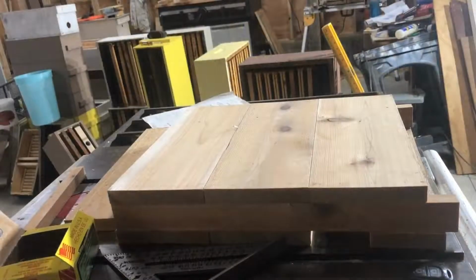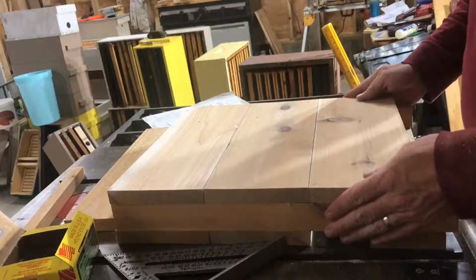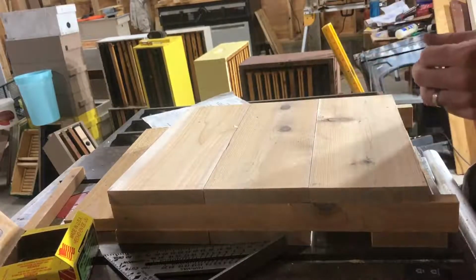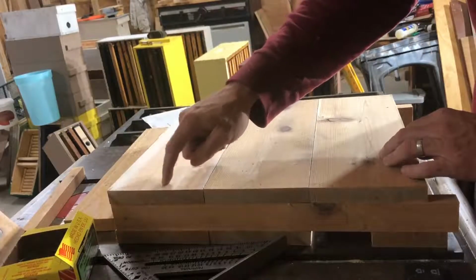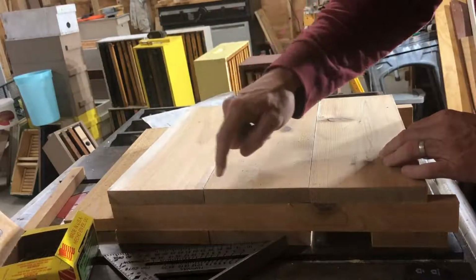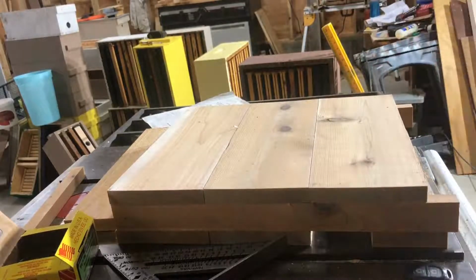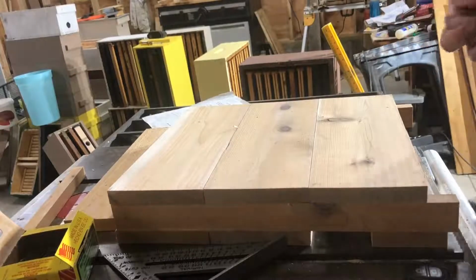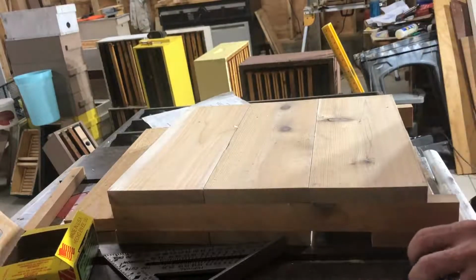Well, I put some more light out with a portable light, and so this is the back. And for the back, I did not want the nails to hit the other nails, so I spaced them out differently. I just went from the top, 1.5 inches, 1.5 inches, 1.5 inches. So it's 1.5 inches, 3, 4.5, 1.5 inches, 3, 4.5. But this is the back. Probably not gonna be seen like the front would be seen. So less concerned about the way the nails actually look, more concerned that the nails are actually gonna be holding and not hitting the old nails that are in the front.